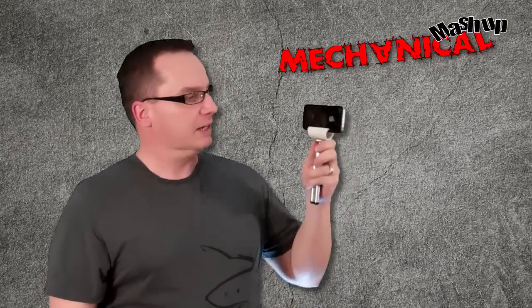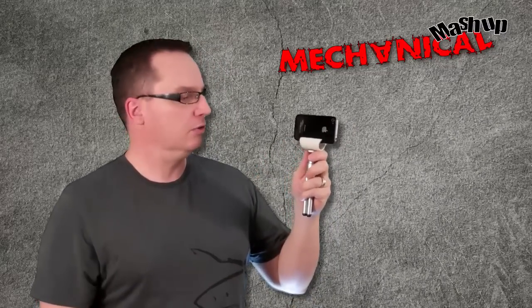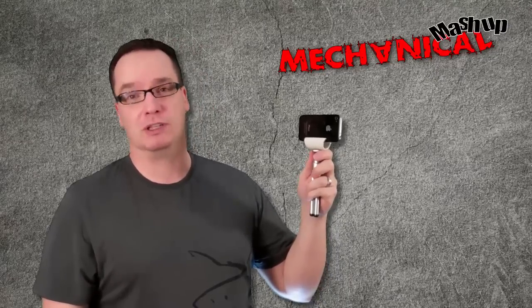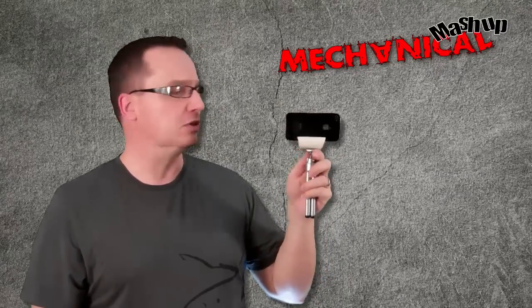Well, there you have it. A little iPhone holder, a little clamp that works really, really well to a 3/4 inch PVC pipe. It took me 4 cuts, I had to drill a hole and tap it. Other than that, you're ready to go. And this is an iPhone exclusive. You could work this into pretty much any smartphone that has flat sides.